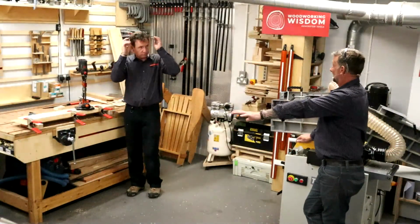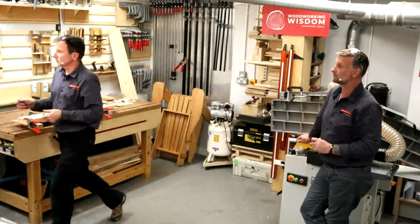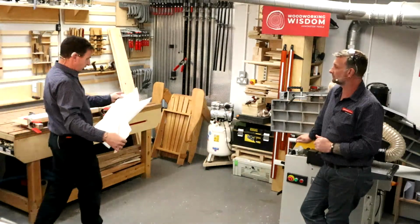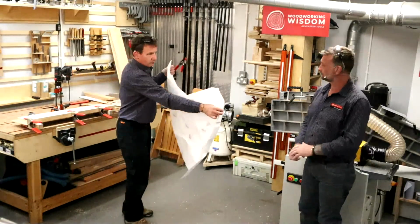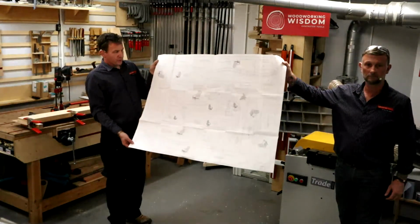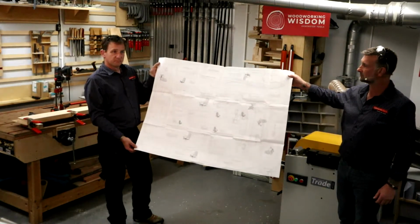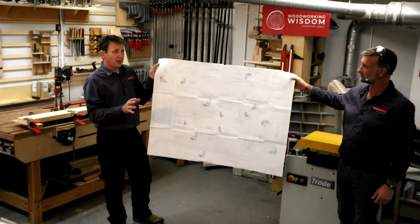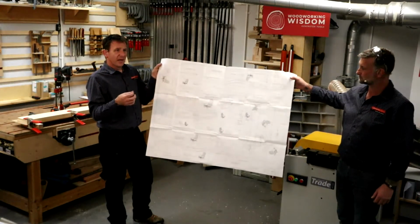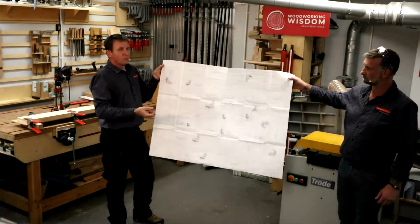The templates. Yep. We made those ourselves from the plans. In reality, I have a paper plan kit. When we made the first one, we bonded this down to a piece of MDF with some PVA. Don't go using spray mount glue or anything; it draws too rapidly into the MDF. You also won't be able to move it. With PVA, you can water it down just a touch, 10%. Put it on carefully, and you might need two people to do this.